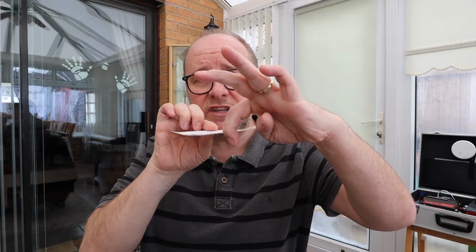So the paper gets jammed, and you adjust the wheel back until the paper can move, so you know the distance between the tip of the nozzle and the bed is the thickness of a bit of paper, because the paper will move underneath the nozzle, between the nozzle and the bed. So you do that for all four corners, job done, that bed is level. Every now and again, you check it. If you change the nozzle, you'll re-level the bed.